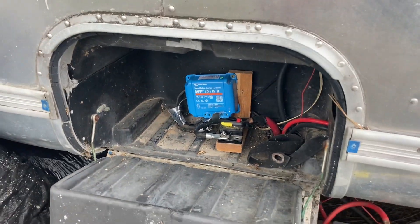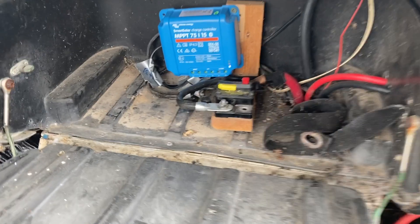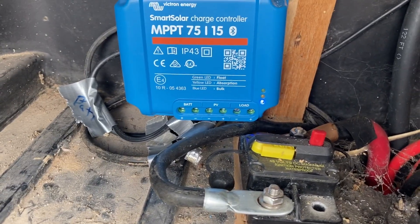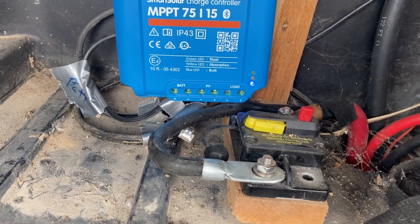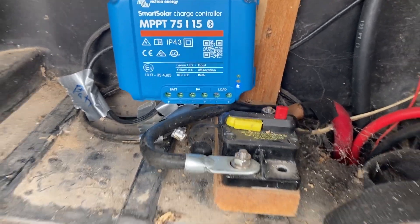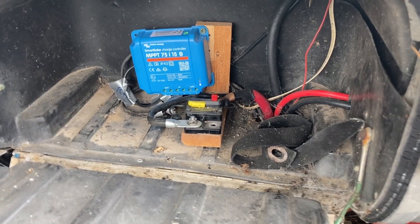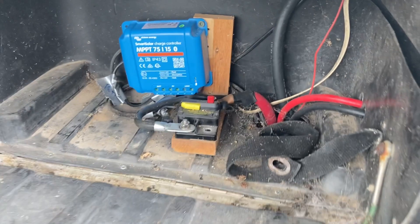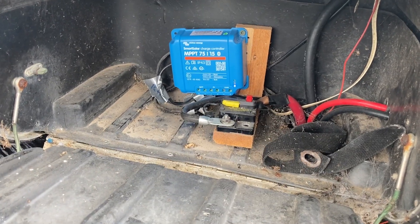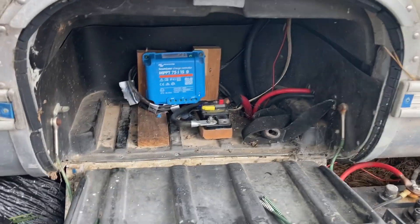Let's give you a little idea of what's out here. Why is there little pieces of duct tape? Well, they mark the positives and negatives. If you can see in there: battery, PV — photovoltaic — which we're not going to use right now. It's in bulk charging mode. These come straight from where it says battery — that goes to the battery positive and negative — and to the panels. It's pretty plug and play. You can also see the main breaker right there. Things are a little dusty in here, sorry, just the way it goes.